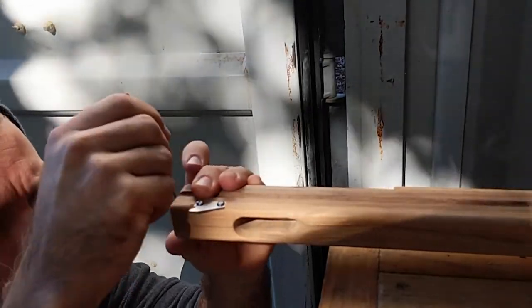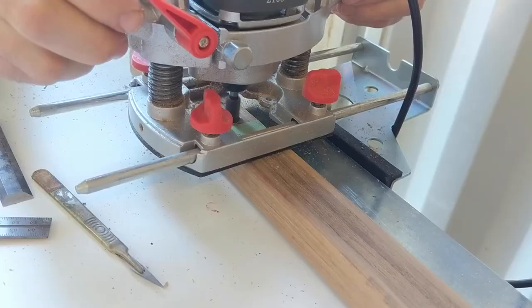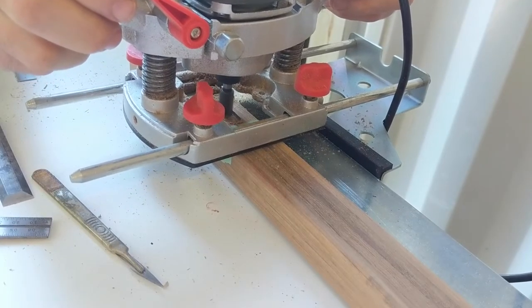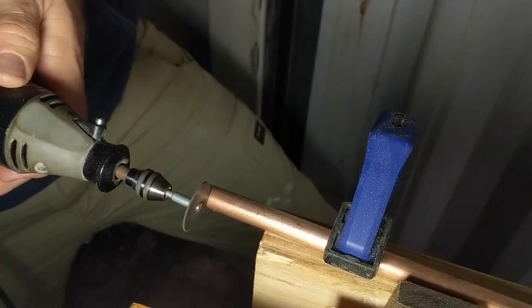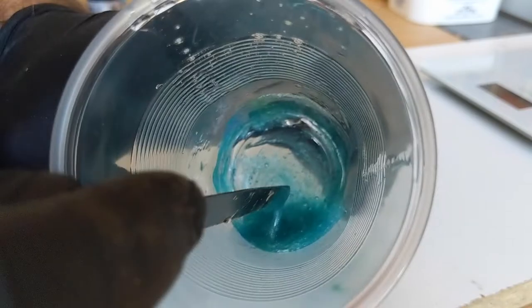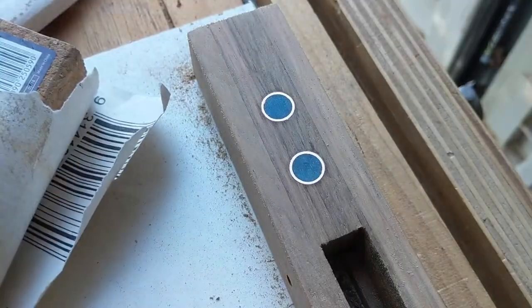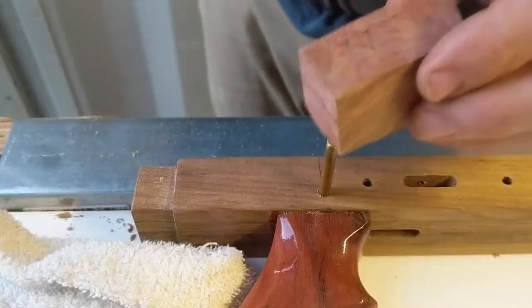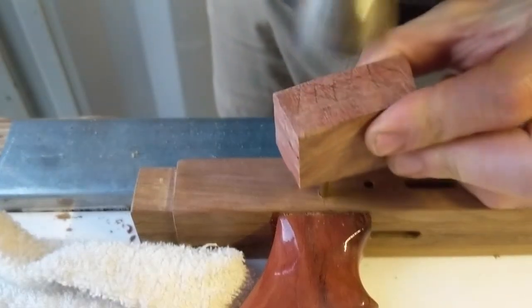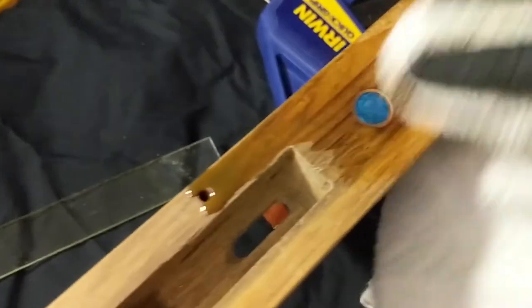Here I'm just putting final touches to the line release to hold the spear in place when it's under load, and back to inserting a few more stainless steel parts onto the gun, routing out pockets, making sure everything's accurate, flush trimming some copper pipe, and mixing up my pearl powdered epoxy for the inlay — again, because the abalone dust was going to be toxic I opted for this method. I also wanted to put a brass pin through the mortise and tenon joint of the handle for extra reinforcement and also to give it a little bit of pop.